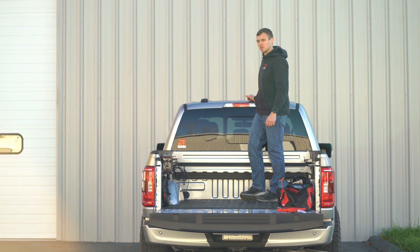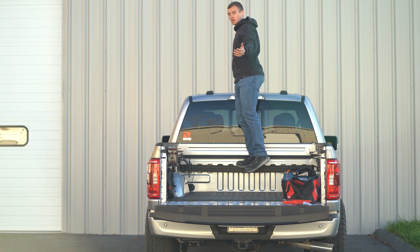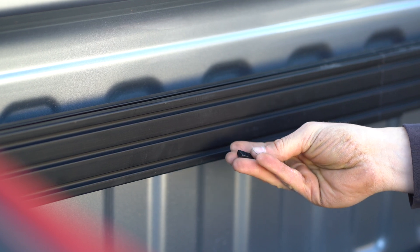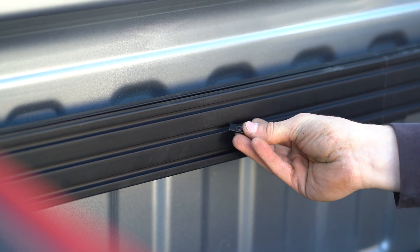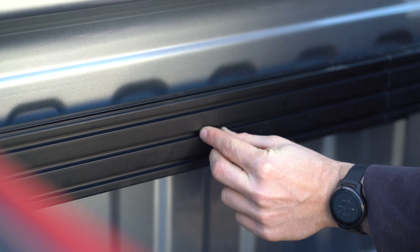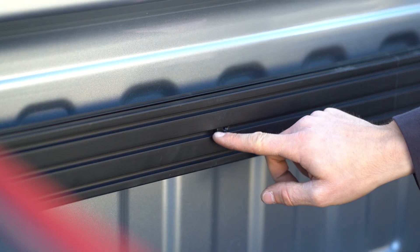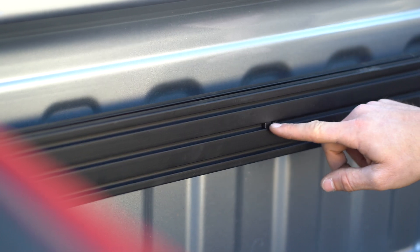You might not be putting 200 pounds of man on your bar, but if you wanted to, you could. In my hand I have a drop-in T-slot nut that comes in your kit and this is what you'll be using to mount stuff to the bar. We include these, which are 1/4-20 thread, and some 1/4-20 button head screws. To use them, slide them in sideways and then they just rotate into place. It's got a little spring ball on the back so it'll stay in place and you can slide it wherever and mount whatever you want to the bar.